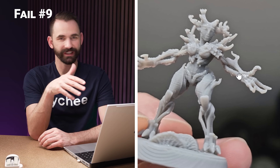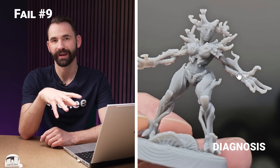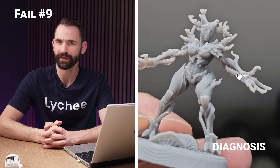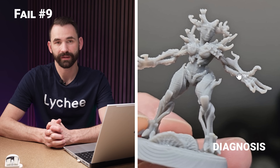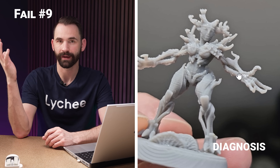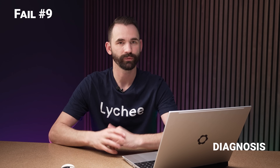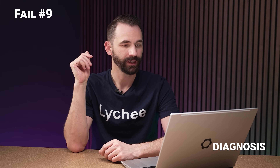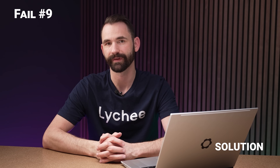And this one's really interesting — I wanted to show this one. This is one I actually helped this user out a really long time ago, like six months or so. This user found a way to make resin look like FDM — not really. What I found out is that this printer was one of the original Anycubic printers, like the original Photon. The Photon can obviously do better prints than this. What it turned out to be was that the lead screw backlash nut was just worn out. So this is just to show you: when you see layer lines or wobbliness, it's most likely something that's moving on X and Y that's not supposed to. I've seen entire Z screws wobble, entire motors wobble — I've seen everything at this point. If you see layer lines like that, look for something that's moving on X or Y that's not supposed to, and you'll generally find the issue.